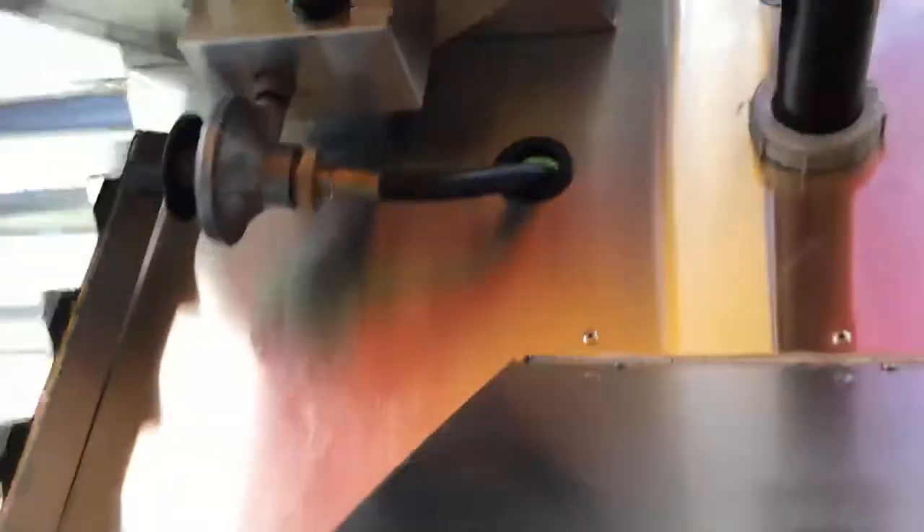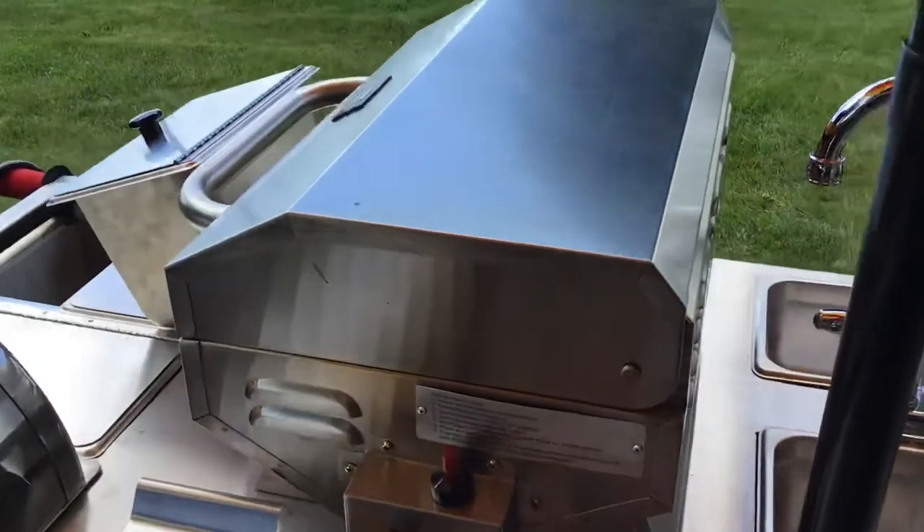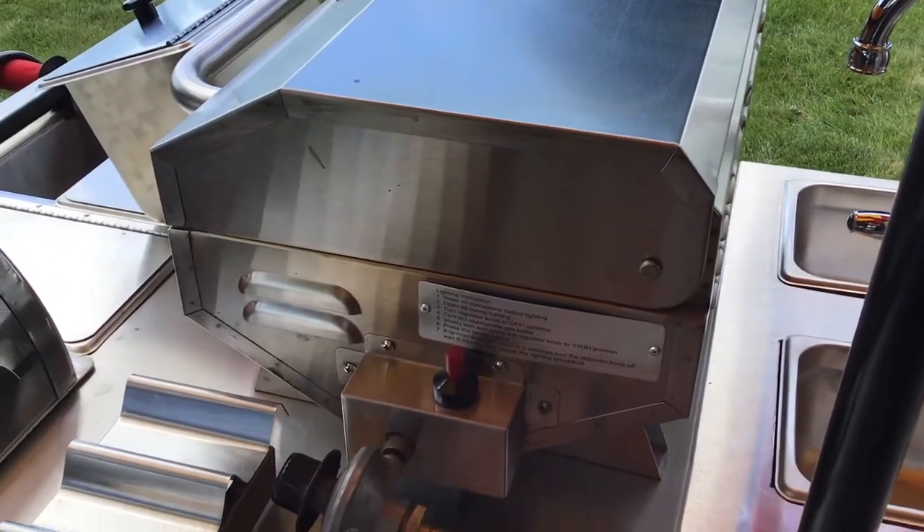You can see in this picture what all the original hardware looked like when I got it home - rusty, which is unacceptable when they could just put stainless in there. The grill works really good - gets nice and hot and fires up every time. I added a side table I got off eBay. Worth noting: the 304 stainless that comes with the cart is really good quality, but the stainless on the side table from eBay isn't as good - a magnet sticks to it, meaning it's a lower grade that will rust if left wet.